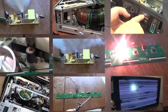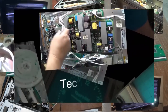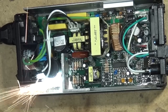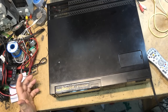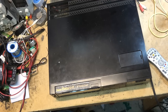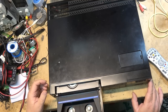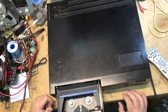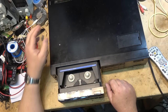This time I'm going to look at a Sony Super Beta, the SL HF 750. This is the one that has Beta 1, Beta 2, and Beta 3 and four heads, with the mechanism in a drawer that slides out to the front. Sony came up with this unique design — it's essentially a top loader machine with the entire mechanism sliding out, just adding complexity to it.